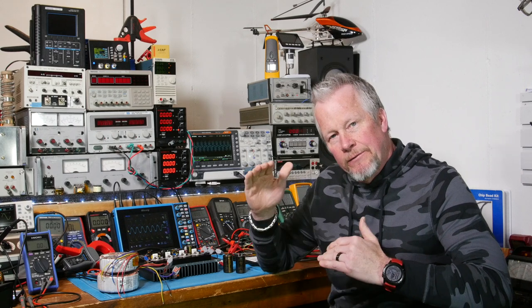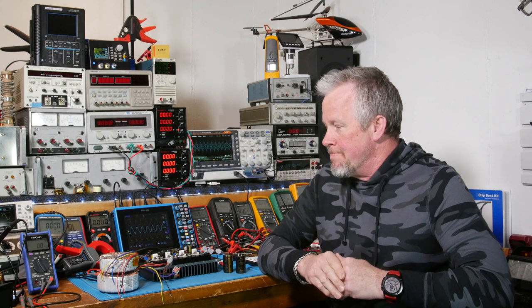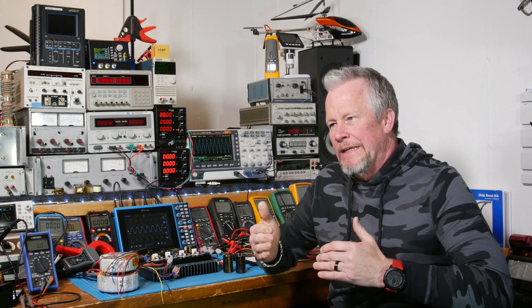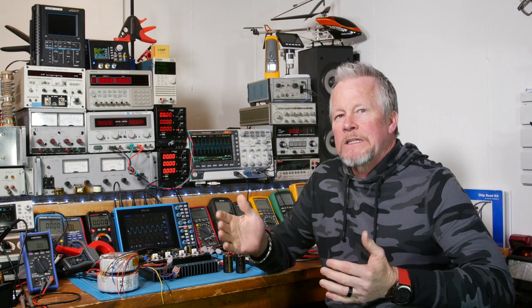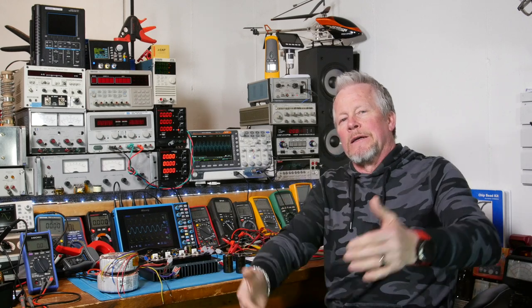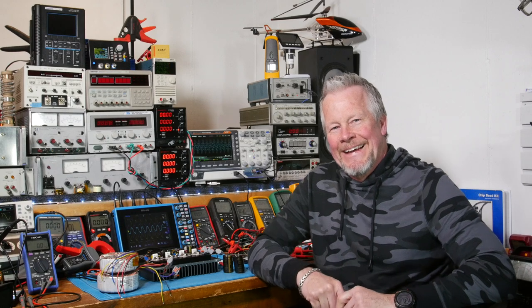So it's close to 70 volts from rail to rail. Where this guy was 22 volts and this one is 25 — it sounds like there's only 3 volts difference, but it really comes out to about 4 volts difference per rail. So if you end up with 8 volts extra and you're putting out, say, 2 amps, that's another 16 watts of dissipation that maybe you can't use. But maybe we need it — so that's what this video is about. Let's come over here and test and see what happens.